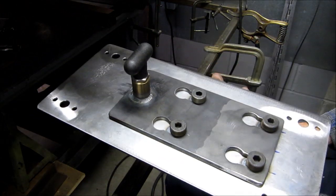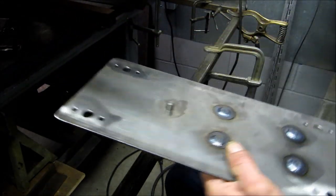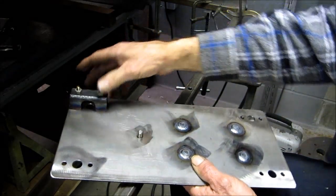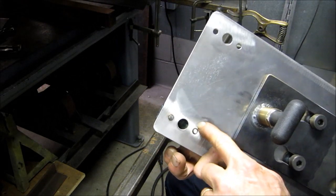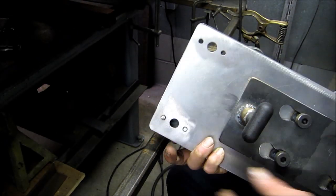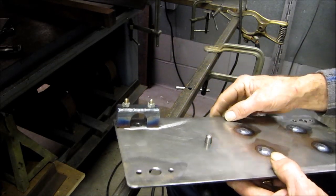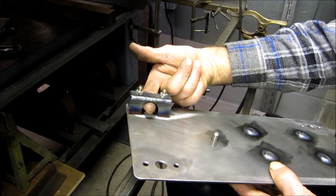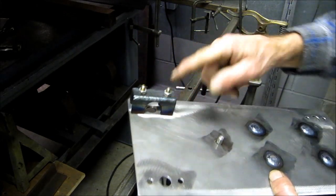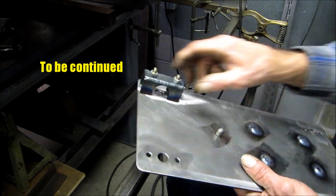Pops right in there. This will adapt down to the hitch on the floor and this will bolt to the top. Our next step will be to go ahead and set these in and weld the grade eight bolts that I've cut off to the right length right to the plate. They'll stay shallow and not protrude up there, and these will be anchored down with lock washers or nylocks. It's set to have compression on the radius of the pipe itself — so they won't meet, they'll get real close, but that's it. I'm going to have a smooth finish off my TIG weld on those. Getting close — wrap it up in a couple of hours.